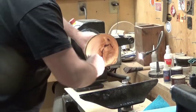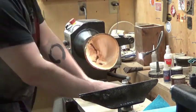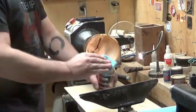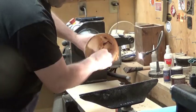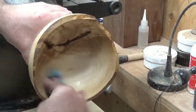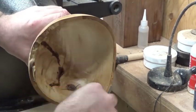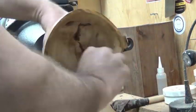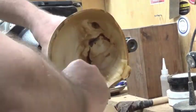It's sanded to 320, so I'm just cleaning it now with denatured alcohol to get any dust out of there. Again I used the Starbond CA into those inclusions — medium black CA. Now I'm sealing the bowl. There's a lot of end grain in there because of the crotch section — the grain goes in different directions. Then I go ahead and use Yorkshire Grit, then Hampshire Sheen, to give me a nice glossy finish.